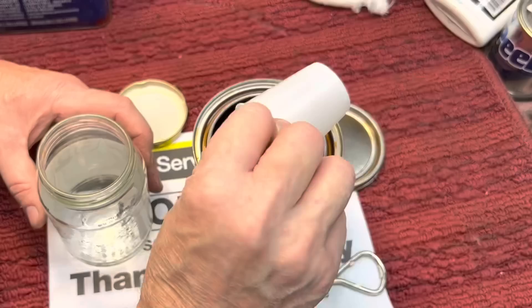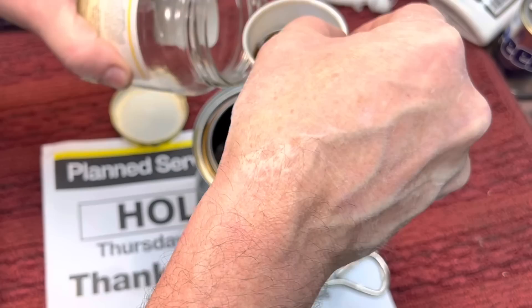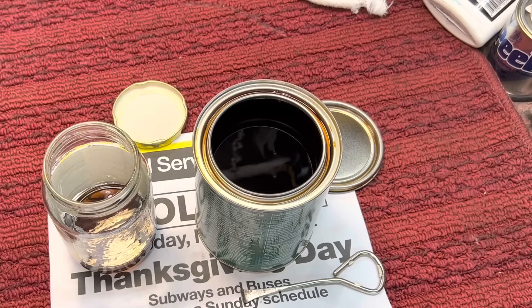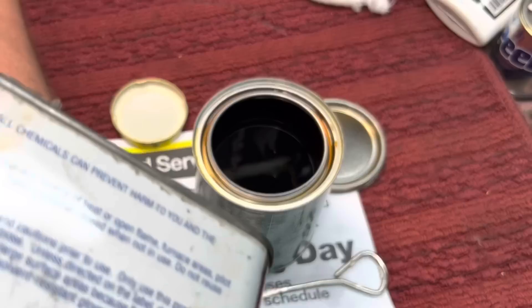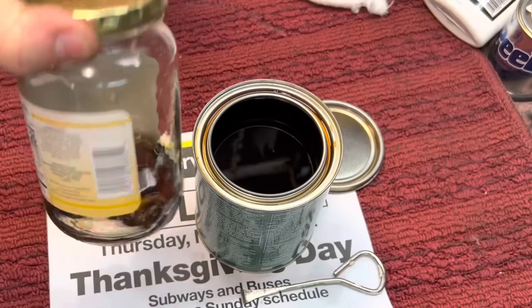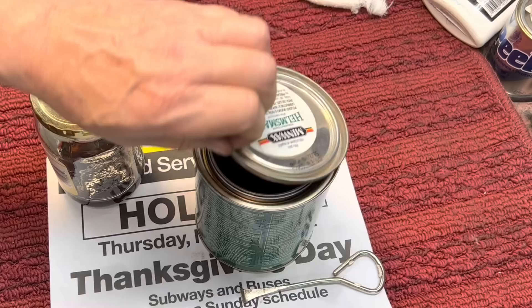While that's drying, for the next couple of coats you're going to take a little bit — this is how I like to get the varnish out of the can without dripping. That's all you're going to need — just put that into a clean jar. You see how much we have in there? That's pure varnish. Now we're going to thin that out with some mineral spirits. I'm just putting a little bit here — that's really thin now. This will be for when we use it tomorrow. It dries so quickly because you're putting it on in such thin coats, and you can put multiple layers on, which really gives you a nice look.